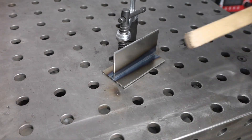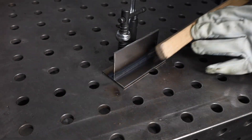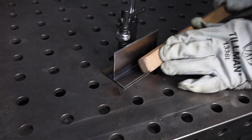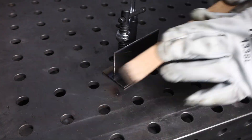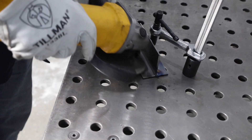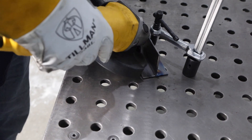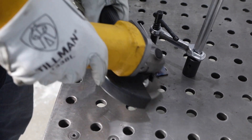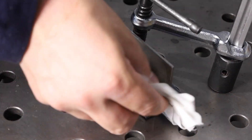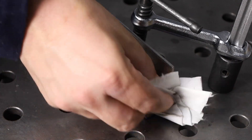The solution to this is pretty obvious: remove that oxide layer. You might be thinking, okay, let's just grab a wire brush. You can do it with a wire brush — notice here I'm just going one direction, because whatever you're scraping off, you have potential to jam it down in that joint and that can give you problems too. So running one direction is nice. I'm usually not that patient and I'll just go for a grinder with a wire wheel. I'll take a quick pass with that wire wheel on the grinder. Everything's cleaned off. Then I can take a rag with some acetone, wipe it all down, and it's ready to go.